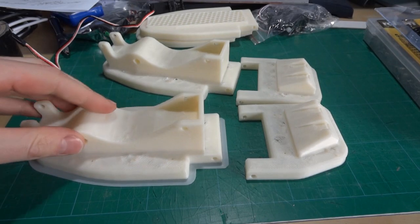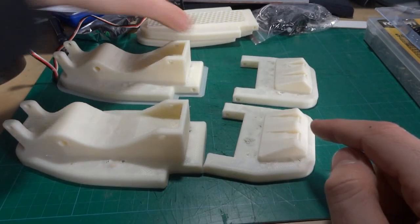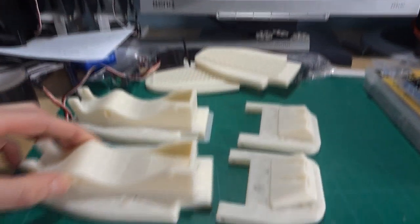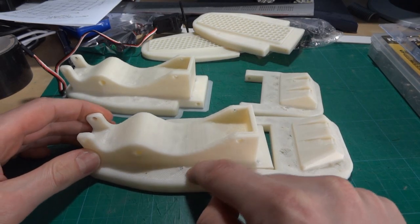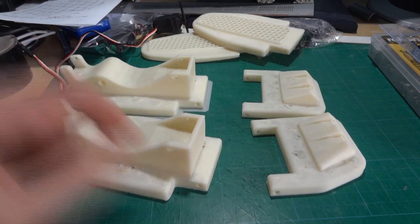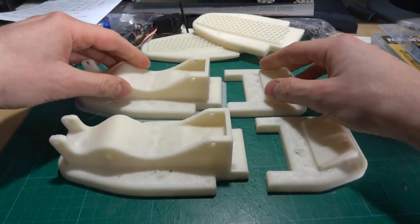I now have the successful prints of the main foot pieces. That's the brim I was talking about, which I've cut off on that one. So there's the foot and there's the toe, and obviously they'll hinge here. There were still a couple of issues on the top surfaces with the denser infill — but these are fine; you can see that's quite a tight honeycomb. As before, the much bigger honeycomb with only 10% infill — watching it printing, the printer's fine bridging the gaps, but it prints quite quickly and sometimes the next line of filament pulls the previous one up and they get rucked up, and the head crashes into them on the next pass. If I'd printed the top layers more slowly, which is an option in the slicer, it probably would have been fine. The parts are full of honeycomb so they're incredibly rigid and more than functional.